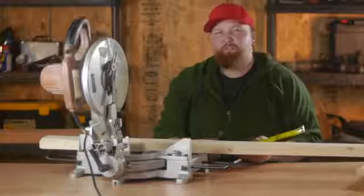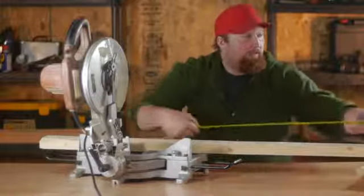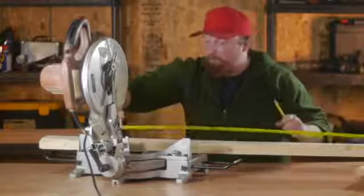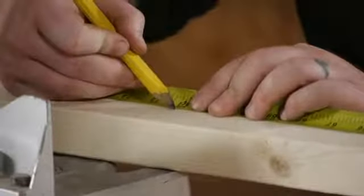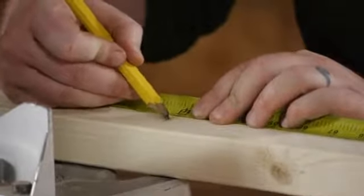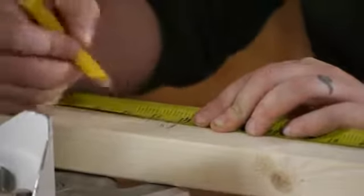The first thing we want to do is put our measurement onto our board. So we'll go all the way to the end of the board, hook our tape there, get our measurement and mark it on our board. Now when I cut, I want to cut to this side of the line so I leave the line there, which is the exact six foot marker.